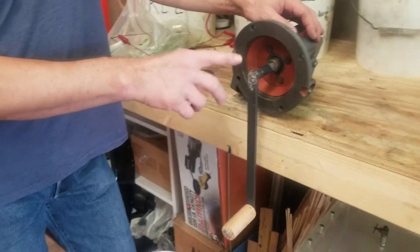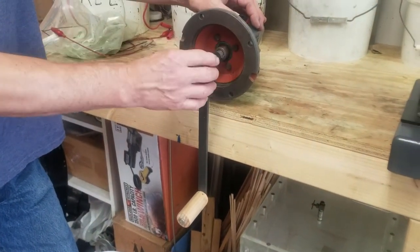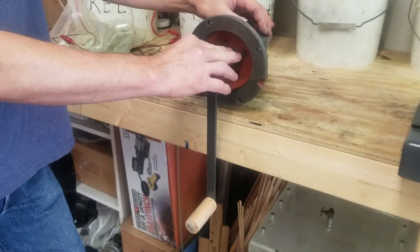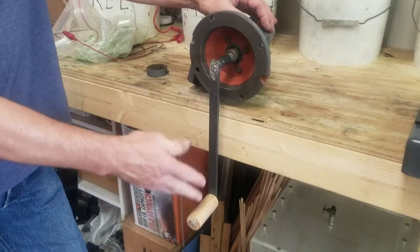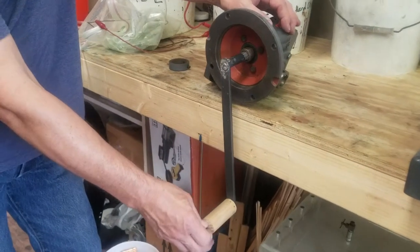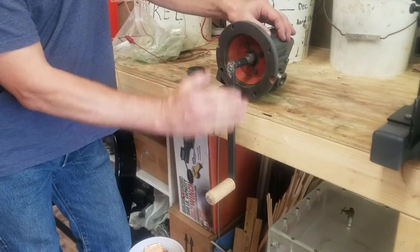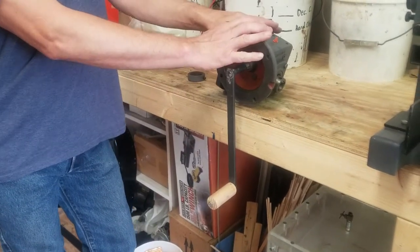So far we've already accomplished making a shaft and a keyway on this side for the input side of the gearbox, and a handle that consists of a strap, a bolt, and a large dowel that we've turned. This is your input side and this is a 60 to 1 gearbox.